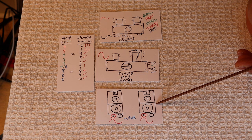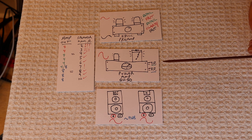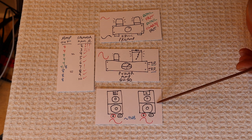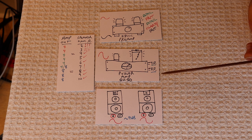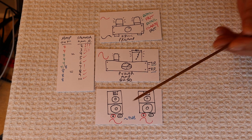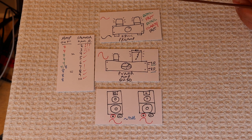If you've got a less efficient speaker, maybe with a huge amount of power it'll sound good — but why would you want to do that? Power costs money, it makes for complications, it just doesn't make sense to me. I would go with more efficient speakers every time. If I had a choice between two well-reviewed speakers and one was more efficient, it doesn't take a genius to figure out what I'd choose. The less efficient your speakers, the more power you're going to need.